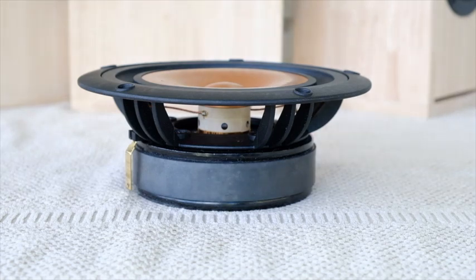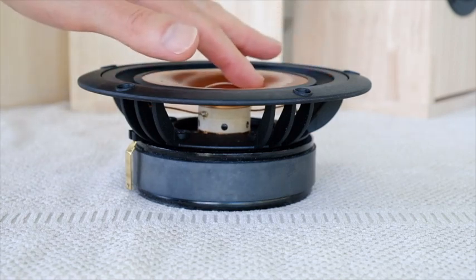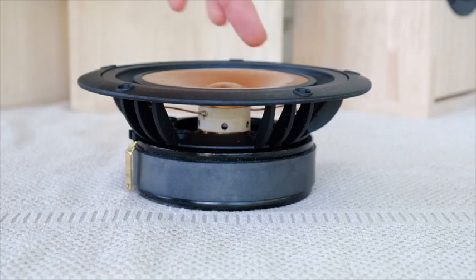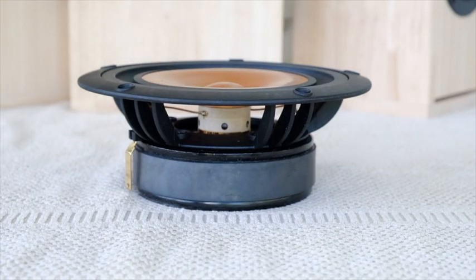In terms of musical performance, naturally we're all individuals and will evaluate music differently, so I'll make a general technical observation. The combination of no rear suspension — reducing restriction on the coil — and the shallow cone profile, which reduces any phase differential between bass sound generated by oscillation and mid and high sound generated from the center portion and cap of the cone, means we get an almost seamless transition from bass through middle and high range and back again. Many peers and co-workers who have listened to the 11 MS all remark on how seamless that transition is.